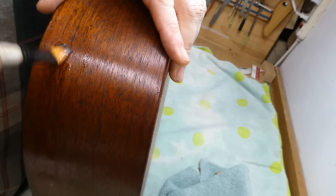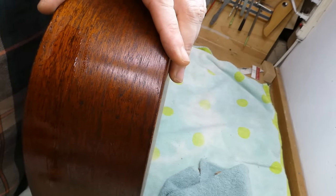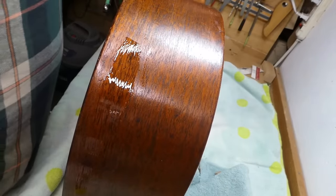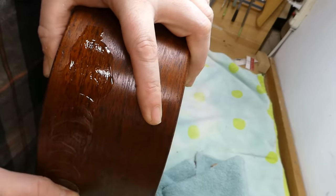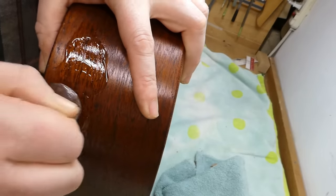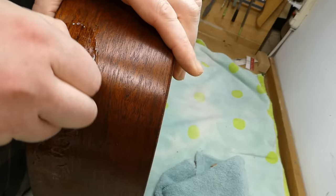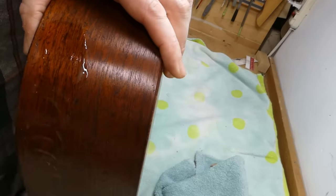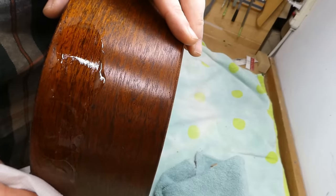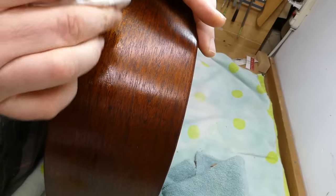Let's start on the side crack — it's a good place to start. Important to get these looked after; you start off with a little crack in the side and you're one good bump away from having it split all the way around the guitar, which is a much more annoying and expensive repair. Using the suction cup to force the glue through the joint, being quite liberal with the glue. I'm using fish glue — could just as easily be Titebond. I'm not that kind of glue snob.